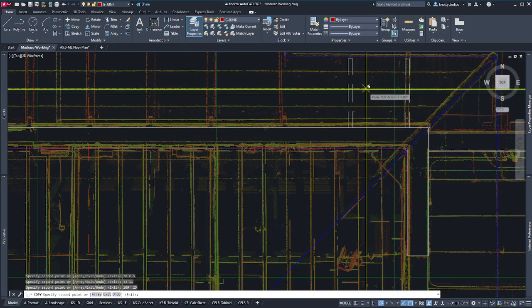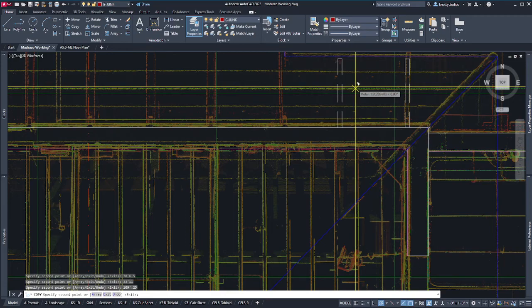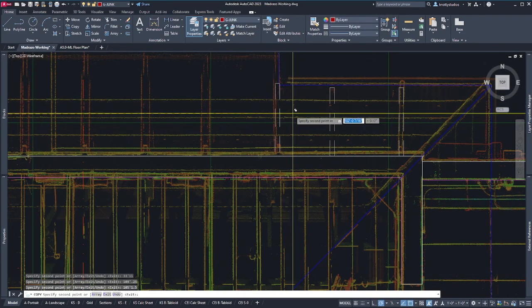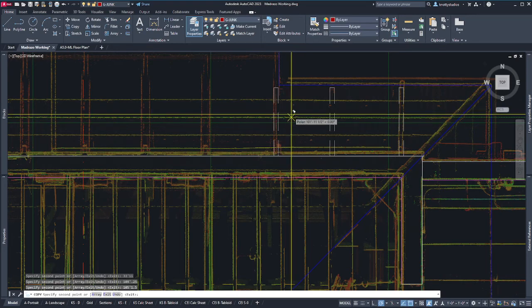And so it dropped one there. I come back, I see a ghost of one here. I could check another slice and see what I got, but I'm going to drop one here because I think it's pretty close. So I got 105, 1.5. So 105 feet, 1.5 inches. Drop one there. And then at this end of the spectrum, again, it's kind of ghosty. It's kind of hard to see exactly what I have, so I've got to look at other things to figure it out.